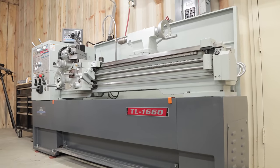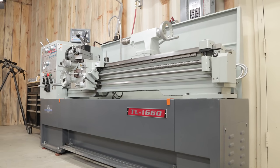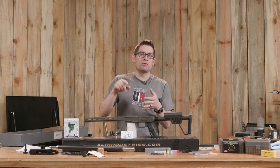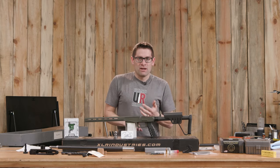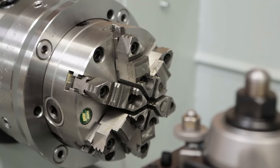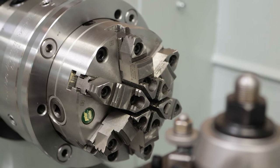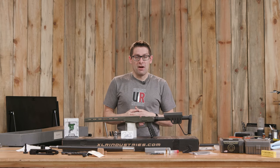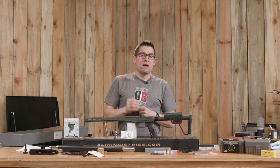This is a beast. It's big, it's rigid, it produces great surface finish, and it has some really great features. I'm using the Truebore alignment system. This allows me to do axial and radial adjustments to get the bore running perfectly true, so that when I'm threading the muzzle or when I'm chambering, I'm dead on. For this build, I've enhanced that a little bit.